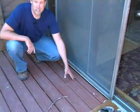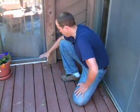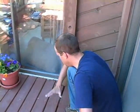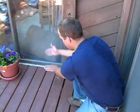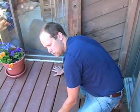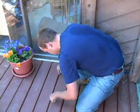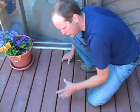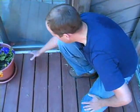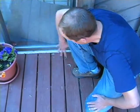It probably wasn't done. The main water leak, though, that we saw that was actually wet is in this area. Again, we have another slider door going to the deck area, and at this intersection is a critical flashing area. We're restricted from our inspection in many ways. I can see that the roofing material below is there, but I don't know what the age is, don't know what its condition is. All we know for sure is we have a water penetration problem and that it's coming from this probable area right here.